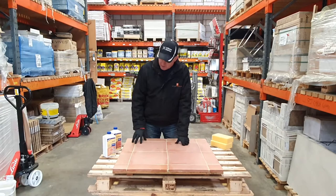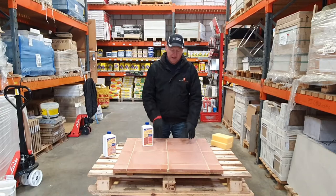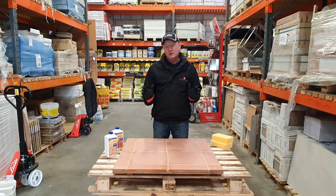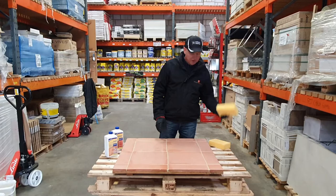To seal it we're going to use the impregnator, which creates a barrier to stop any stains or help reduce staining. Then we're going to use the sealant over the top, which is going to leave you a modern look — like a honeycomb, sort of golden look. You're going to need a couple of sponges: one to apply it and one to take it off.